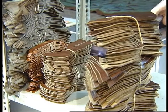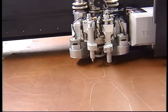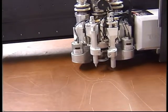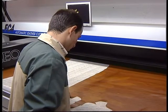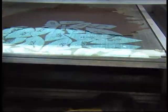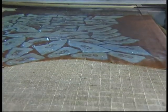The automatic cutting system also allows making demarcations on skins, which traditionally are done by hand in the cutting section or stitching preparation section, and serve as fundamental guides for correct accomplishment of stitching operations. In short, the automatic cutting system has several advantages over traditional processes, namely: considerable decrease in response time, elimination of cutting dies, flexibility for small series, optimization of raw material use, and greater rigour and quality.